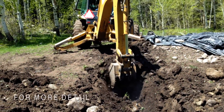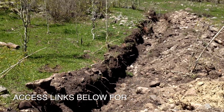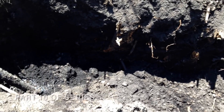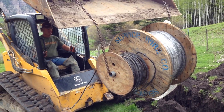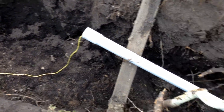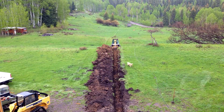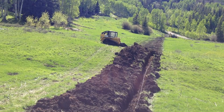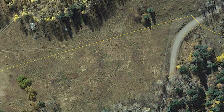When we resumed work in May of 2014, we had measured the necessary transmission wire and began the process of installing a conduit from the powerhouse to where we had crossed the road. With the conduit in place, we pulled the first 300 feet of wire to the powerhouse. A trench for the transmission line was dug to the house and properly bedded and buried for a total of 1,100 feet from the powerhouse to the house.